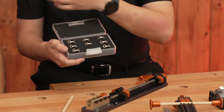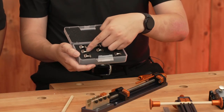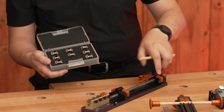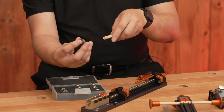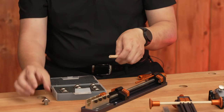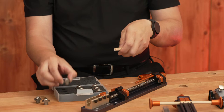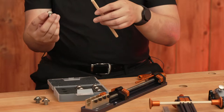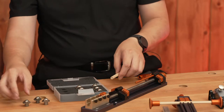The 1, 2, and 3, exactly what you mentioned: one is the largest, two is a medium size, and three is the smallest hole. So when you are pushing the pencil through this die, you start from your hexagon shape, go through the number one die, the largest one, to cut it to a circular size of that specific diameter. Then it goes into the number two die, and it cuts it a little smaller. And number three is the smallest, which is the end result of how big your pencil will be, the final diameter or thickness of the pencil. That makes sense.